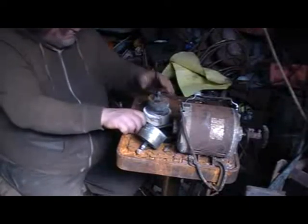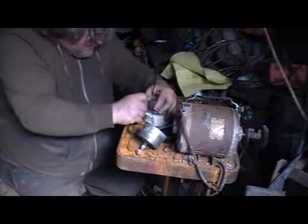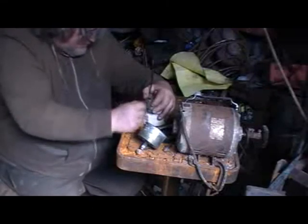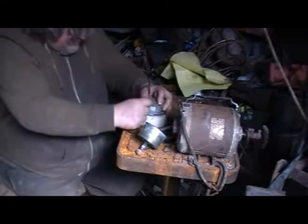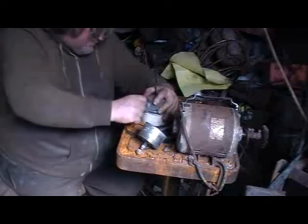What I do here is press down on the clock quite firmly and just push the metal over in a couple of places to locate the clock, rather than try to get it all done at once. It just grips the clock in the right place so that when you start to fold the metal in on itself, the clock isn't going to be loose.